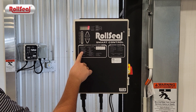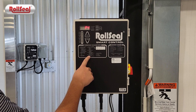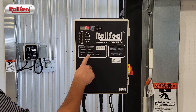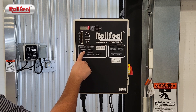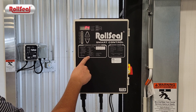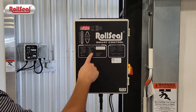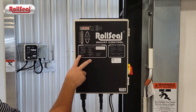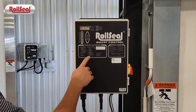If you want to use both the fully open and fully closed indication, you can use a combination of P4 and P24. P24 controls aux 2, the second dry contact inside the controller. So if we want to read both states, we'll set P4 to three and P24 to one. With those parameters, if you're wired into both aux 1 and aux 2 contacts, you can monitor the door when it's fully open and when it's fully closed.